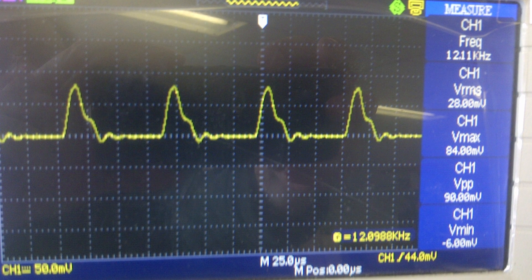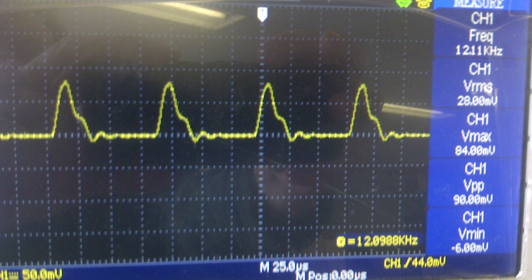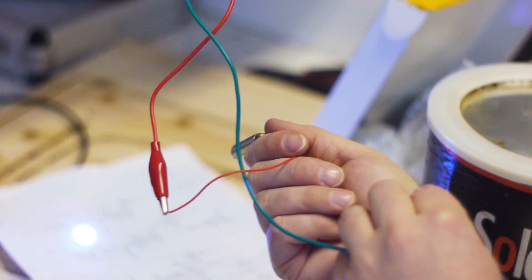The other odd thing with the laser was that even though it draws 60 milliamps on average, it draws it in spikes of about three quarters of an amp. So it averages out, but it needs to be able to handle that 0.75-amp spike at around 40 kilohertz. This board already has a modification on it to use that FET, and I thought that was solved.